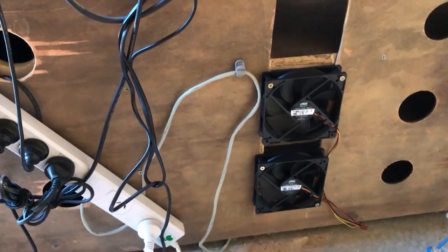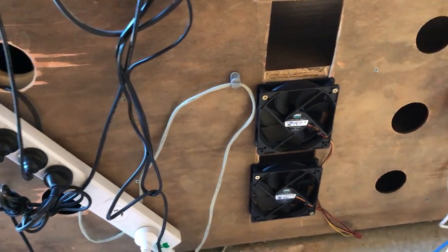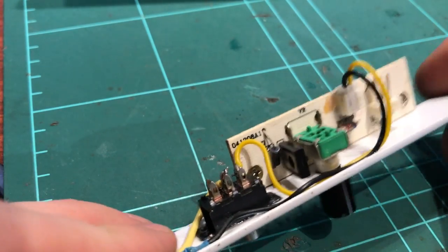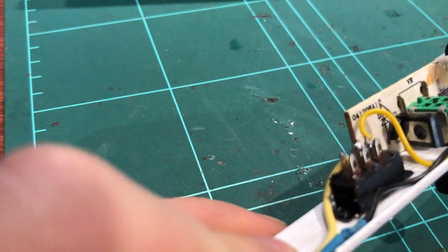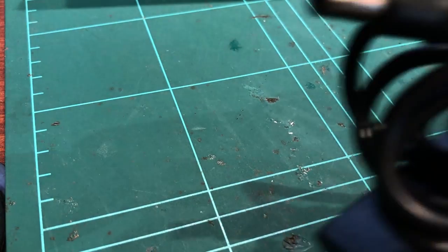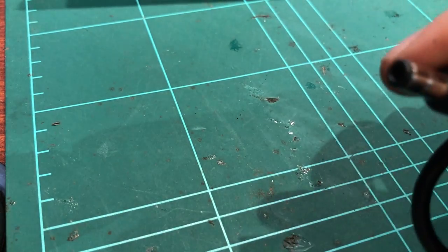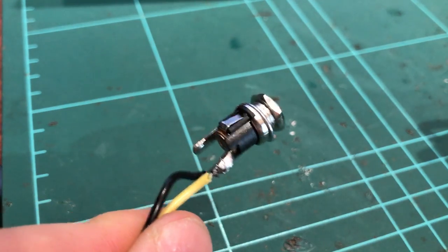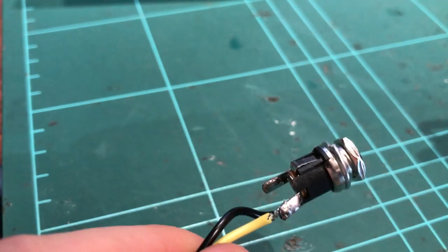Alright, so here are two fans mounted and the third will go just above them. I might reroute the actual power cables through the cabinet first. To wire this thing up, I'm actually going to power it off my homemade bench power supply from a previous video — 12 volts, 5 amps. I'll tap into that power supply off its DC barrel jack and put a corresponding jack on the other end to tap off 12 volts.